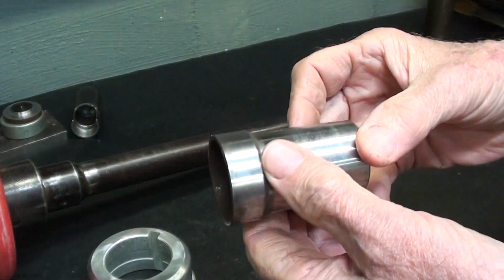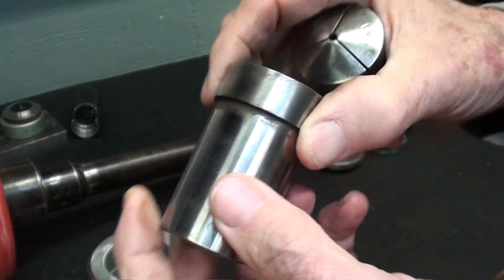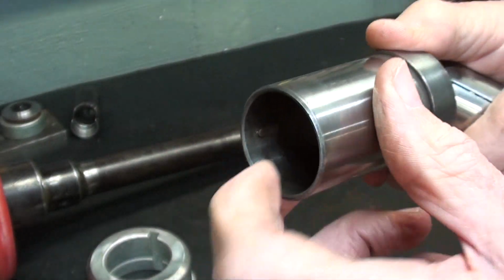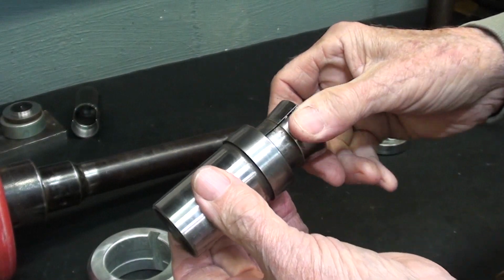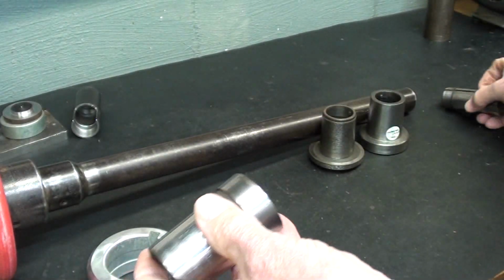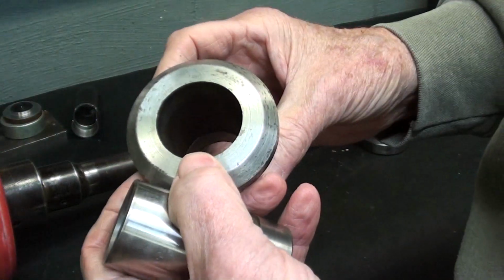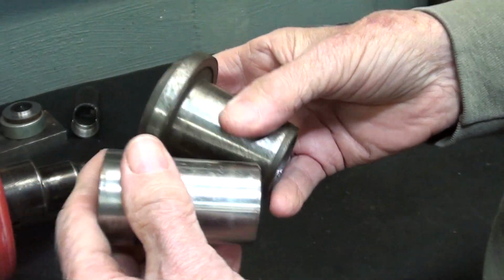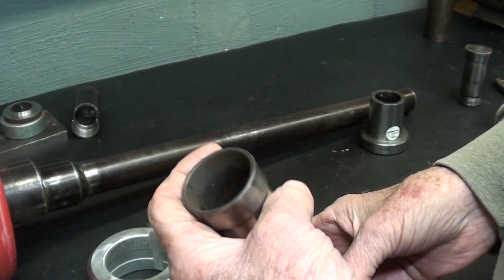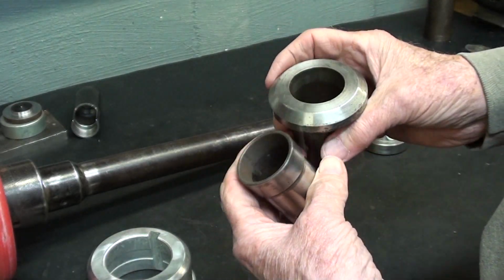And this is the adapter for the spindle that is keyed, if you look at it, right there. So it fits, no, that's a chip. That's the key. And that's how the collet fits in there. However, Paul explained to me that at one time, apparently, the adapter had a flange on it like this, and he removed it, and I guess the reason was so that he could leave this in the spindle even though he had a three-jaw chuck mounted, so he didn't have to take them on and off. So I guess that was the reason for it.